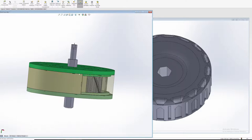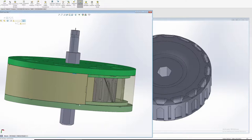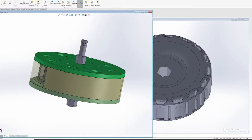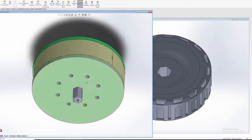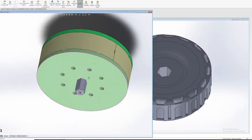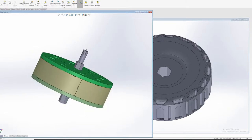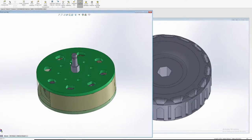What I ended up relying on was these little holes here — tiny holes to put a screwdriver in, which helps pry the mold apart. Using just these tabs was enough to make the mold release when I used the mold spray. If for whatever reason it didn't come apart, I could try the screw holes, but I never actually had to do that. So that's all the parts of the mold. These all get 3D printed, so let's go ahead and print those parts out and start making the wheel.